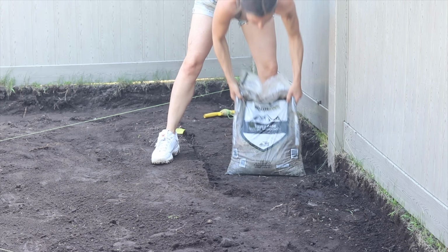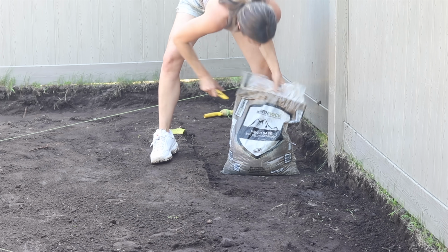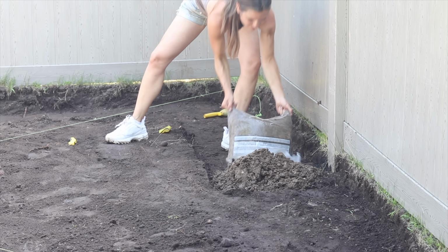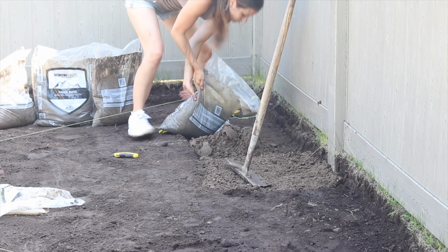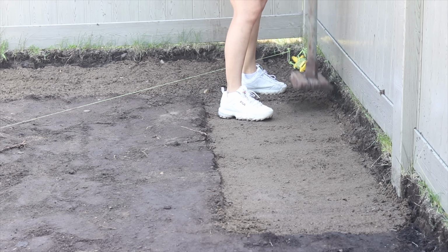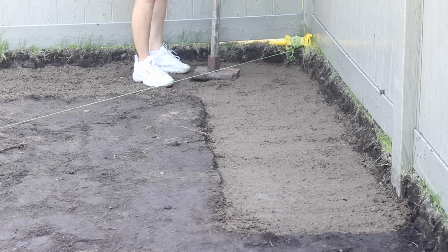I'm going to add in those 2 inches of paver base, which is the aggregate you usually lay down before retaining walls, and I just thought this would give me a stable substrate to build my concrete planters. I dumped multiple bags, leveled it out, and then tamped it to 2 inches thick. The trench kind of held it in place where I'm going to build my walls.